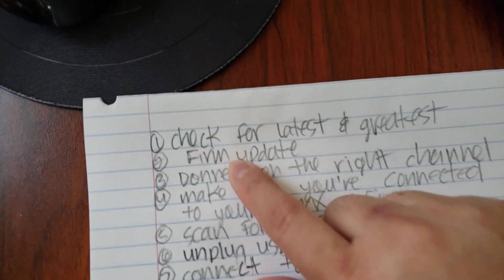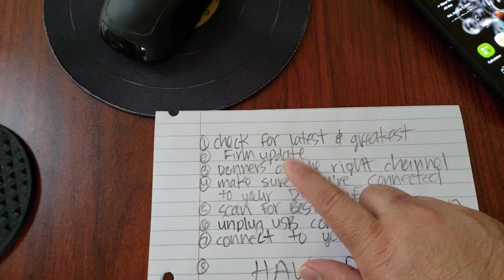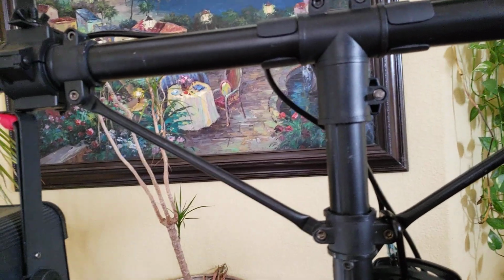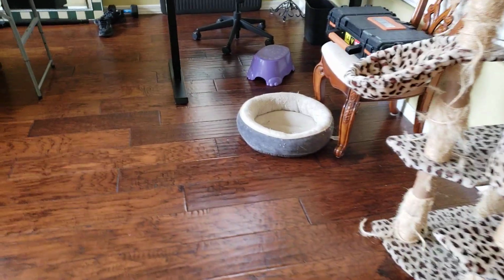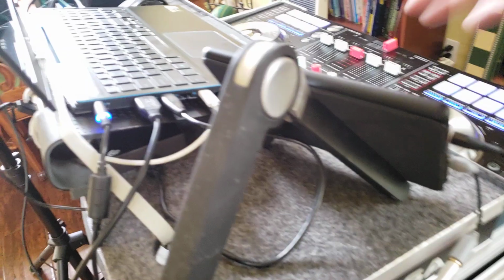All right, let's go back to my lessons. So try changing the channels. I didn't write it on here. Another thing also is raising your mydmxgo elevated. I should have written it down here. So put that in there, elevated. What I mean by elevated, I have mine always connected right here, my mydmxgo, so the antennas are lifted high, right? So when they send the signal it goes over everybody's heads and connects to all my lights. I don't have mine down here, sending the signal hitting everybody's bodies, with everybody in the way. So I never set mine on my table. I always set it up high.